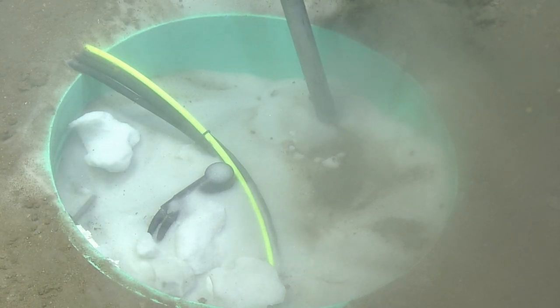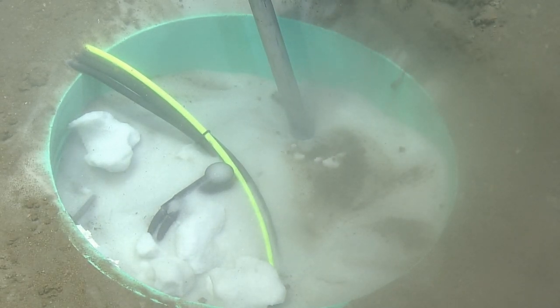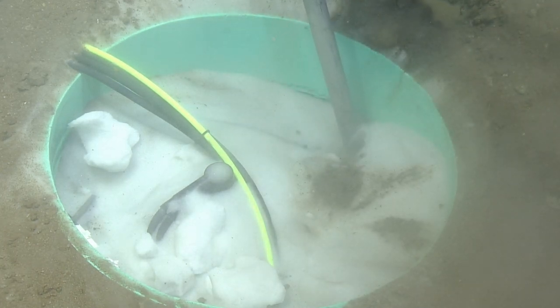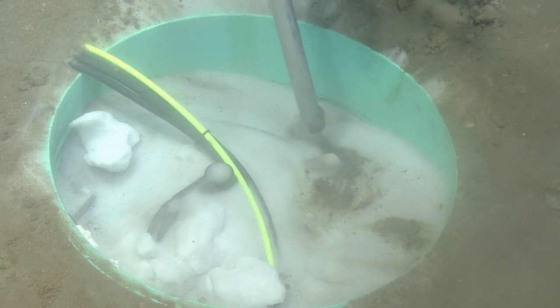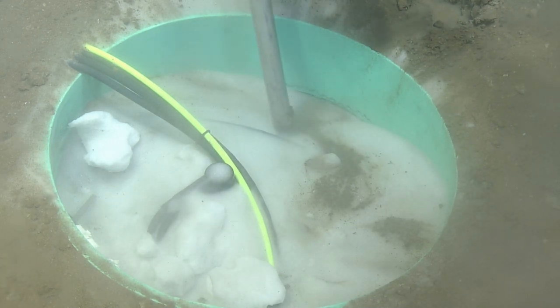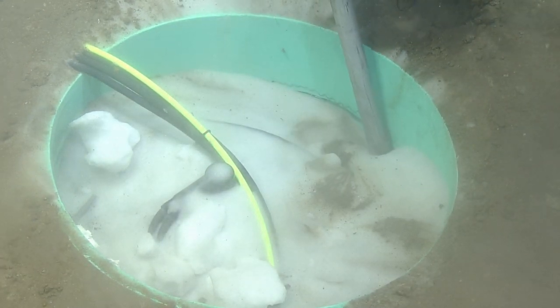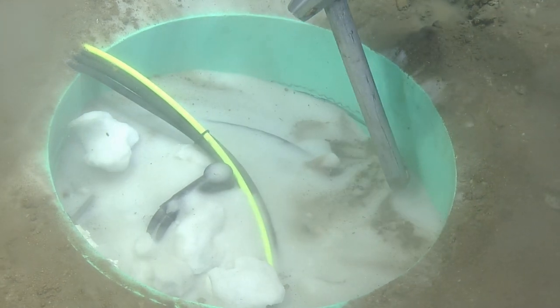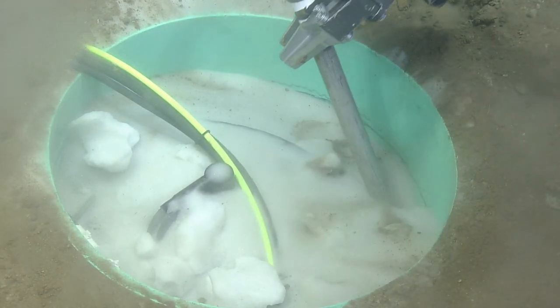Dirk, what's the principle of operation for this type of pump? For the pump? Or this type of suction? He said venturi, like it's reducing a diameter. It's a jet of water inside of a pipe that creates a low pressure area on the backside of the jet, which creates a vacuuming effect. Oh, okay. That's it, yeah.